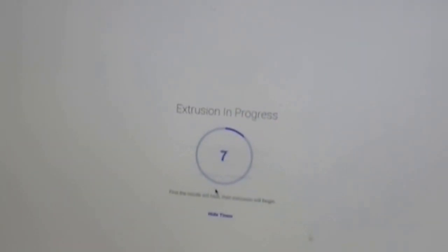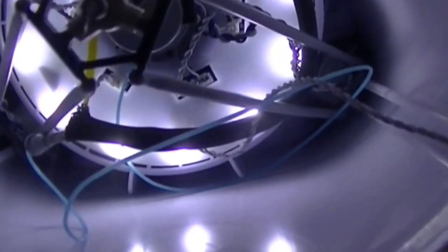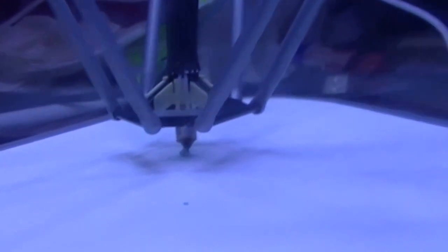I'm going to keep doing this until I can get a good flow. I was sitting here trying to extrude and wondered why nothing was coming out — I looked up inside the carriage and found the problem: the connector feeder came undone. I unplugged everything, took everything off, removed the jam, inserted new filament manually feeding it, extruded it out, and now we're doing the demo print to see how it comes out.